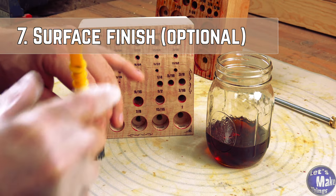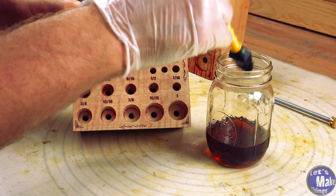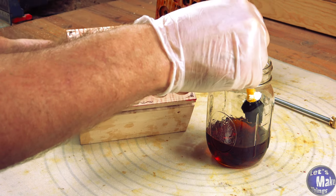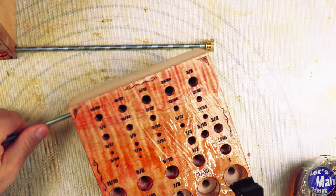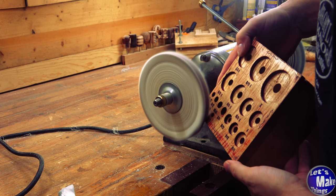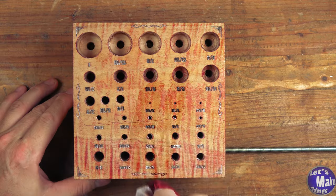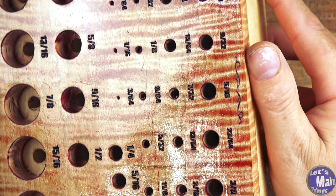I've gone ahead and mixed some polyurethane and paint thinner — this is a little more than a three to one ratio of polyurethane, but I wanted to make it really thin because I want it to really penetrate into the wood. Curly maple has a lot of depth you can reach if you cut this thin. I can use these really thick silicone bristles and don't have to worry about leaving any paint brush marks. After the poly was cured, I lightly sanded it and then brought it to the buffer and used some aluminum oxide compound to give the surface a mirror look. Then I added Danish oil — it's really worth it, because the chatoyance in the curly maple just explodes.